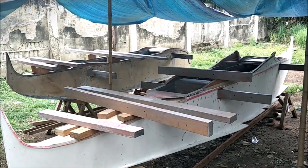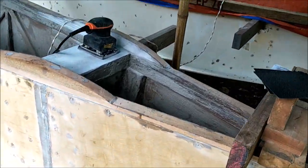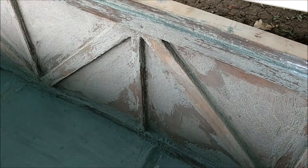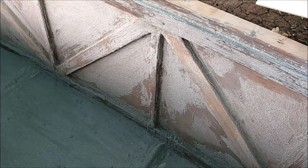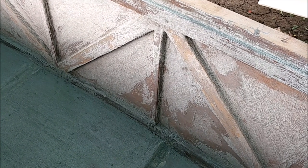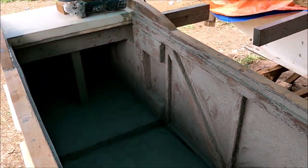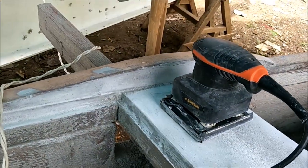We're back after epoxying, and remember those bubbles? They're a complete mess. Don't mix your epoxy very thick with lacquer thinner because it foams up and makes bubbles. You've got to sand all that down and that is work — it's epoxy, not something soft. This whole hole was done with a thick mixture and the whole thing's got to be sanded with 60 grit. A lot of work.